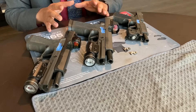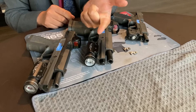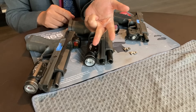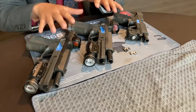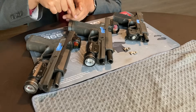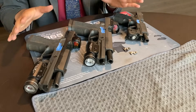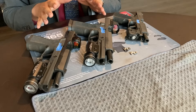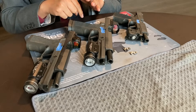Clearly, however, the striker is being released, doesn't care about the secondary sear, and is not being accompanied by reports of parts breakages. This, by necessity of the tolerances within the slide in the FCU, requires that the sear moves downwards to release the striker. On every P320 I have examined, there was not sufficient clearance for the striker foot to slip over the sear without the sear moving downwards to provide that clearance.